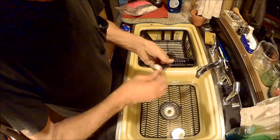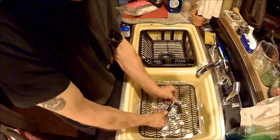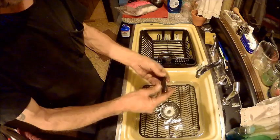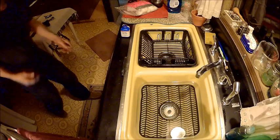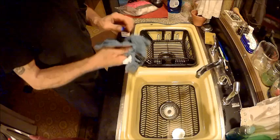We're done with that cotton ball. Now we just put it in here and it stops the rust process. Because that's all blue is. It starts the rust process. And there we have a blued pin. So now, go ahead and throw these away. Dry my hands. And then we'll dry this.